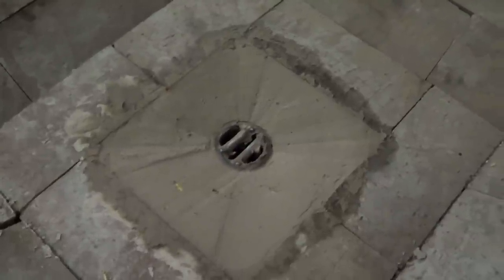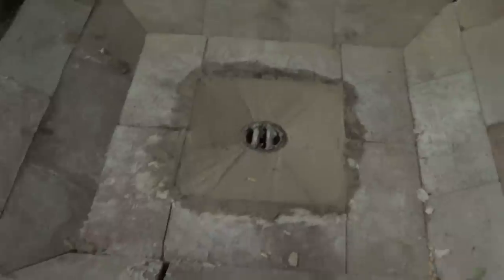That is the second coat of that stuff I've put in there. This is basically fire brick clay, but it's a powder, and you mix it in with your mortar for when you're doing fireplaces and stuff like that with fire bricks. It's kind of experimental. I'm hoping that it'll basically make one solid brick rather than that mess that was in there before.